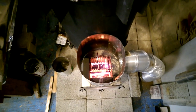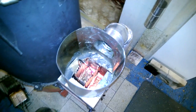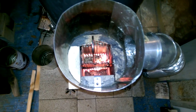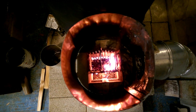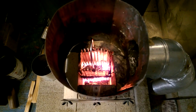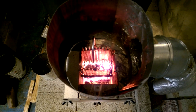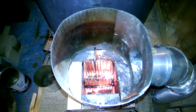Sealing it off retains a lot of the latent heat inside the stove so it can continue radiating whatever heat was stored. If I don't do that, it just continues to suck air in from the outside and cools itself down rather quickly. Now we're just getting to the point where the top of the pellets are burning — that is about five, five and a half, almost six inches from the top rim. That's as close as the hot embers get to the tip of my downspout.